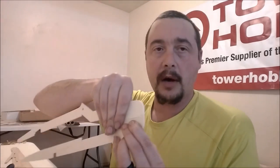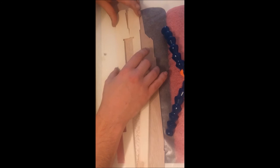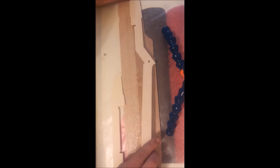We're going to make everything nice and smooth, then come back and apply the stiffeners to the fuselage side. Just a quick note while I'm sanding: you don't want to bevel the edges or anything like that, because this is a part that's going to lay on a part to stiffen it up — that's why it's called a stiffener. All you want to do is just go around it and get rid of all the burrs, all the splinters, things of that nature. That way we just have a nice part. We have our top and bottom piece — they fit really well, we've got rid of all splinters and rough edges. Run your hands all across and you won't feel anything bad.